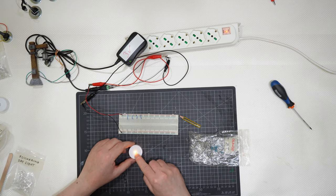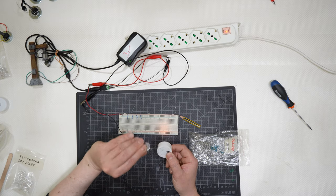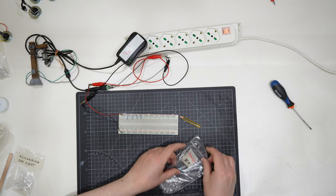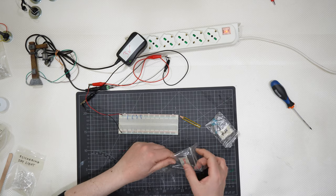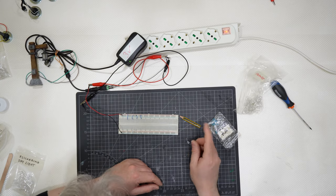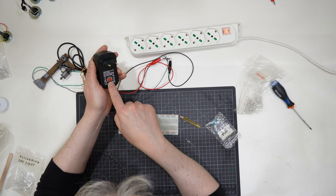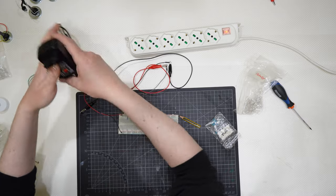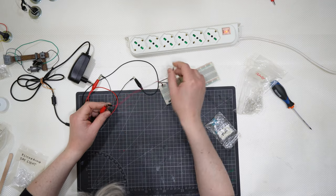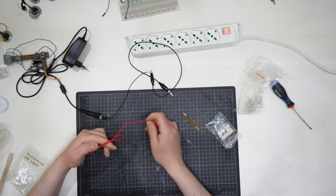And this is a particular LED that is not standard, that works with a 3-volt battery inside. Those batteries are inside here, but it is not white, it is orange. If you want to use some orange, which is between 2 and 2.1 volts, like those ones, and you want to use those multi-switch AC adapters that don't go below 3 volts, you need to use a resistor. Let me try to explain why. Here, positive is red, negative is black.